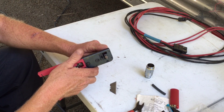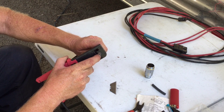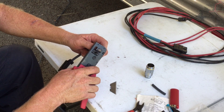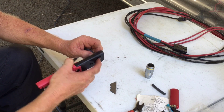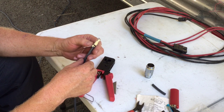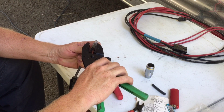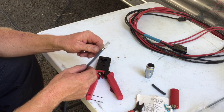After flush-cutting the wires off, I want to pull them back just to where they're flush on the back side of the plug, because if they protrude out they can make it hard to put the plug together when you go to stick it in. So now we crimp it, double check to make sure everything's good. Then I just take and make sure my bleed wire is on there — nicely crimped on as our bleed wire.